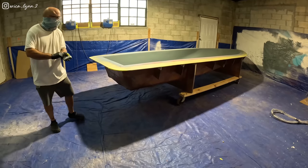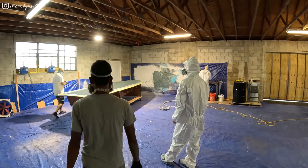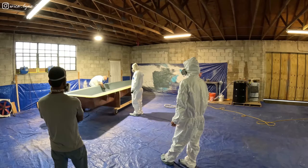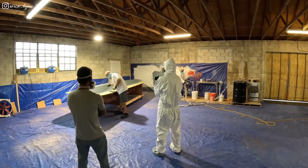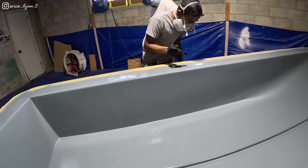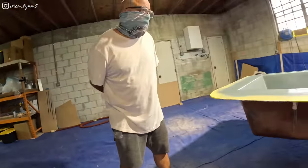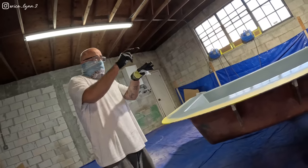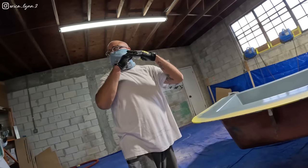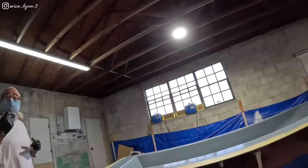Hit the rim and we're done — reading 26. All the way — we're good. Right now we're looking for any orange, any little hole that could have possibly been missed. It's very sensitive — he told you — if we leave any tiny hole, when we later do the skin coat and apply the resin on top of it, you'll have a styrene attack. It'll start to alligator — basically a chemical reaction — it starts bubbling up. So we're just really looking for that.